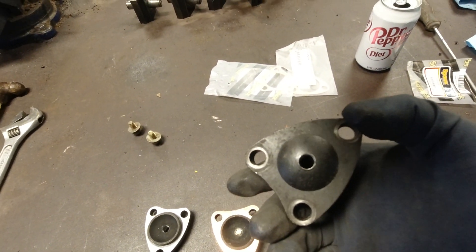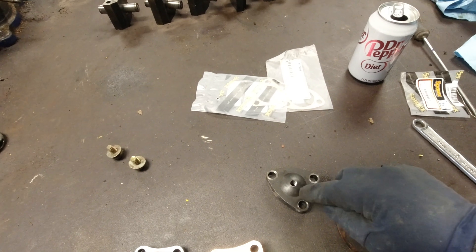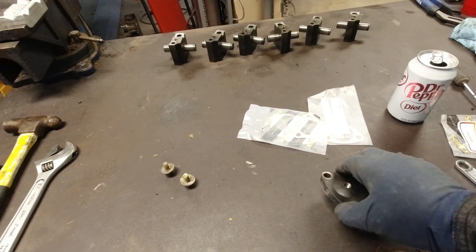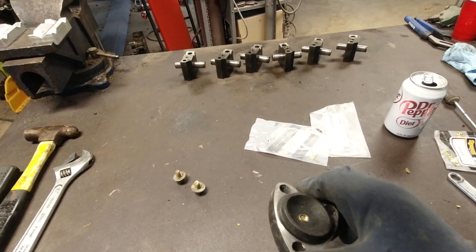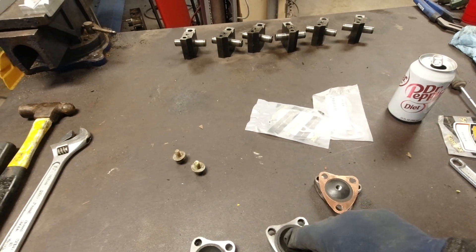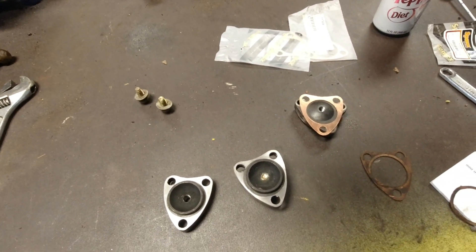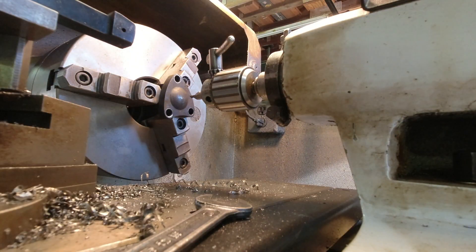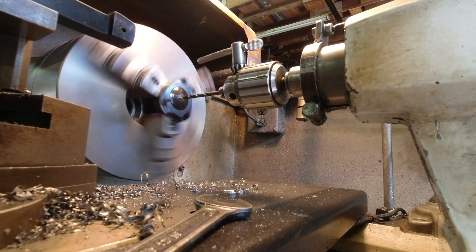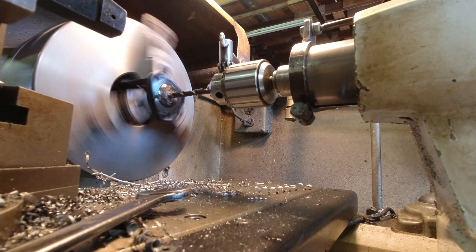The hole you see with a tapped hole — that's a hole I actually chuck up on the lathe on this round part, drill the center hole in the center, and I'm able to put a long bolt in it, then chuck up on the bolt in order to do the machine work. This is what it will look like. I actually put a bolt in it flush, put a washer and lock washer on it, crank it down good and tight — that'll never come out. And I've restored the integrity of this bowl. This is the initial setup for the machine work to create center line on these combustion chamber caps, so we can do the machine work on the face side for the 20 thousandths reveal to improve the sealing of these caps.